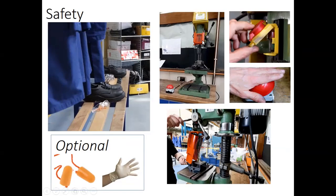We have a drill press in this session. The drill press is the most dangerous equipment because it's rotational, high power equipment. It has two emergency stops: one on the bench and the other on the machine side, at the left side of the column. We have to locate these before the session, so we can directly press one if something goes wrong. Even if you're a bystander, just press it if you feel something dangerous. If you stop something, the power is cut immediately and danger is avoided. It's better than just letting it keep running and become more dangerous.